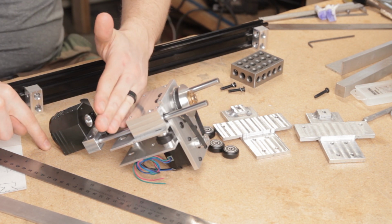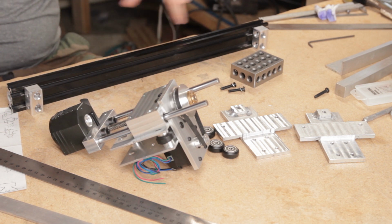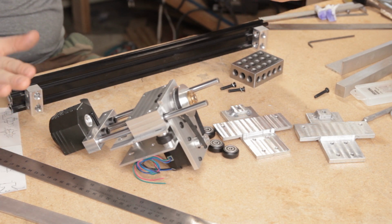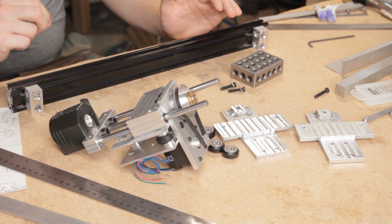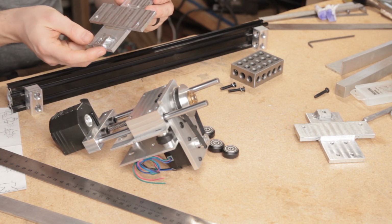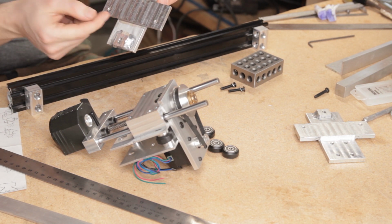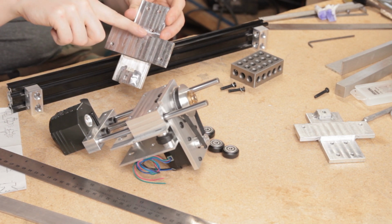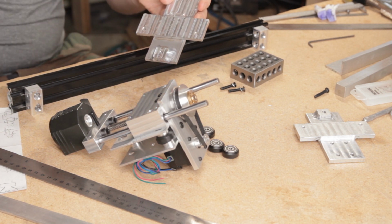And then taking this and contrasting that with my planned design for the actual base frame with the Y rails and then the connections on each end, plus the effective height of these brackets, which in this case is the difference between the top of the Y rails, which is just below this edge here, to somewhere up here where the bottom of the column is going to sit, which looks like it's pretty much dead on 40 millimeters here.